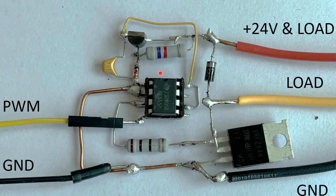Here is the 555, and here it is connected to the Arduino GPIO 9. Here is the IRF Z44 MOSFET. Here is the 24V. The load resistor is connected between those two wires, and this is the ground going to the 24V power supply. Now let's power it up.